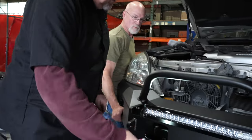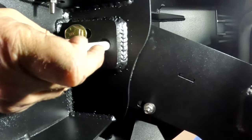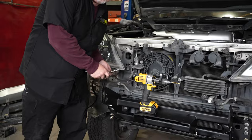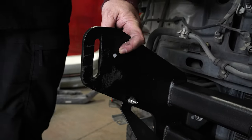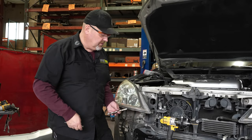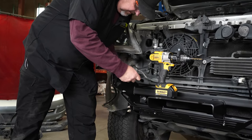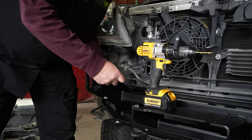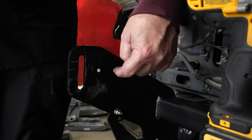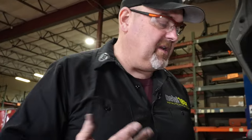We're going to drill a half-inch hole on the mark that we made — that's our locking hole. It's a little awkward to drill in from this side. Any time you drill a hole, you always want to start small and work your way up. I'm going to use a center punch first to ID where the center of my hole is, give myself a nice center punch mark to drill from. Then I'm going to drill from the inside with a pilot hole drill, and it'll be easy to come in from the outside with a half inch to finish the hole.